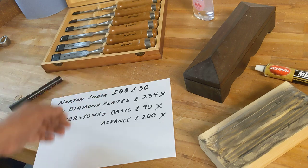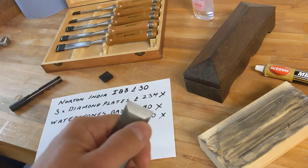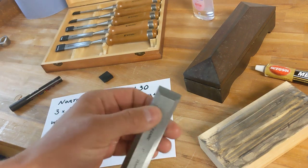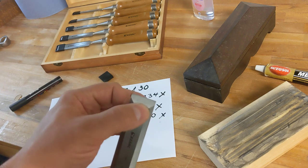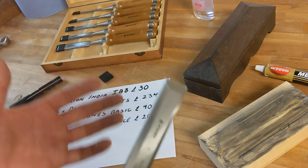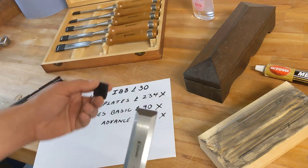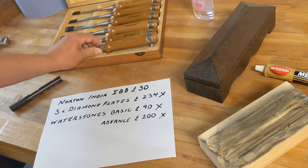Also, the way I choose to sharpen is I don't want to work the whole bevel, especially on a wider chisel. I would choose to do it maybe on a thinner one, but I don't want to remove all of that every single time. Personally, I choose to do all that back there with grinding, and I don't use dangerous stuff, which is like sparks and needs difficult control and you can overheat it. I do it in a very safe, consistent way, and it makes sharpening so fast.